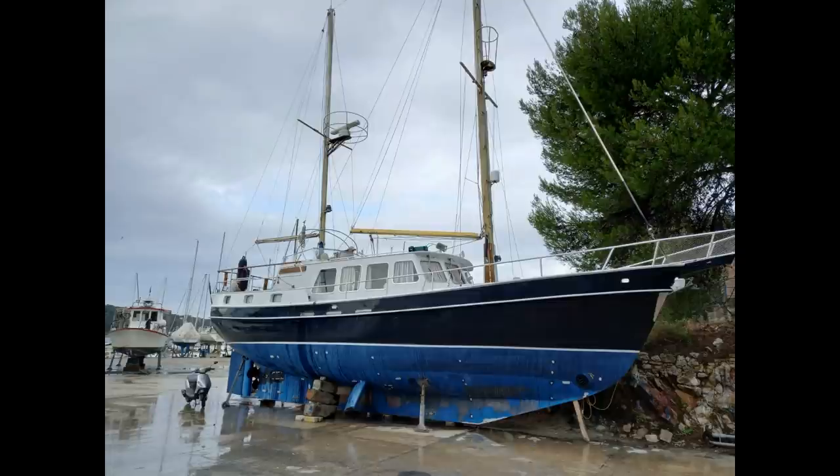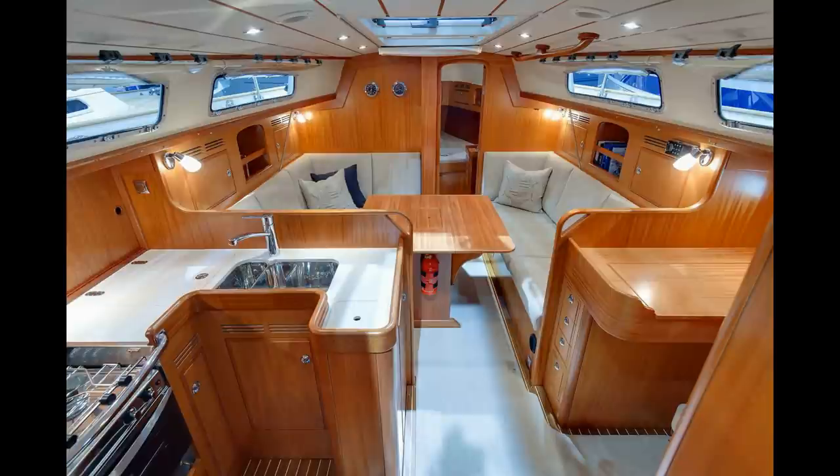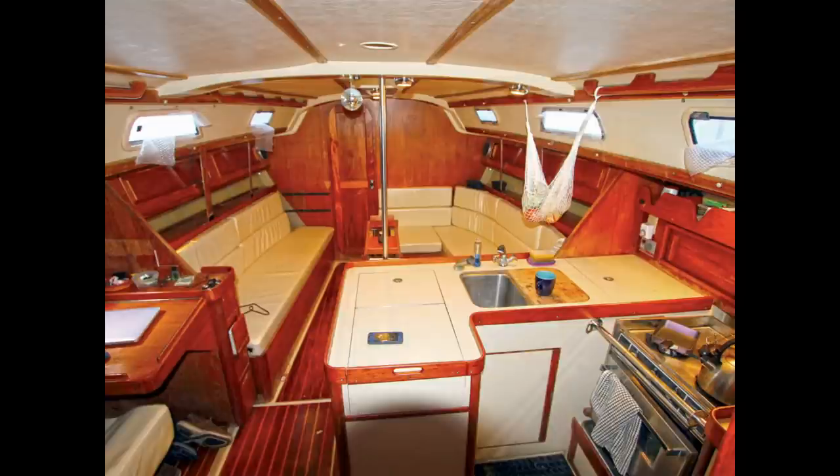To give you a practical idea of the strength of a steel hull: oftentimes on a steel sailboat pointing hard to windward in a really good breeze, the leeward shrouds won't even become loose and wobble around like they do on our boats. Because the hull is so strong, it absorbs the forces of the wind put on the mast. And when you think about the inside of our fiberglass hulls with all the framework and bulkheads, modern steel hulls don't even need any framework. In most cases they don't even have bulkheads, meaning your interior layout isn't dictated by the typical bulkheads we're used to on fiberglass. Steel boats don't need those.